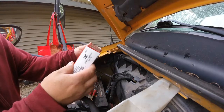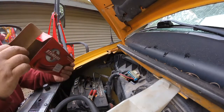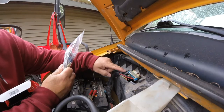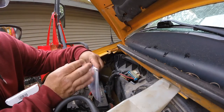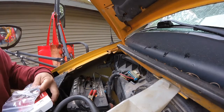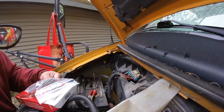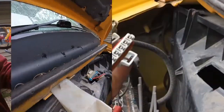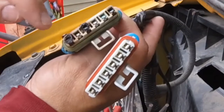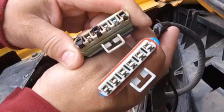I have the new connector to replace the old one. Since all the wire colors are the same, I'm going to do one wire at a time to make sure it matches up and I'm not cross-connecting any wires. I have a couple of tools: this to cut the wire, this to crimp the connection after, and this to strip the ends. Let me show you the difference between the old one and the new one — at least three of these overheated, shorted, and burned out. Not sure why, but hopefully it will not be happening again anytime soon.